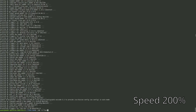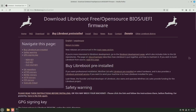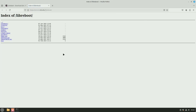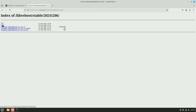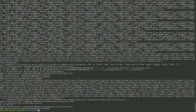From here type ./mk -b flashprog to build the flashprog utility, which is what we'll use to actually flash the BIOS chips. Then go to the Libreboot website, navigate to the download section, scroll down to the HTTPS mirrors, and choose one — I'm using the MIT mirror. Click Stable, then the version (in our case 24.1206), then ROMs, and scroll down until you see serprog. Find the tar.xz file, copy that link, and use wget in the terminal to download it.